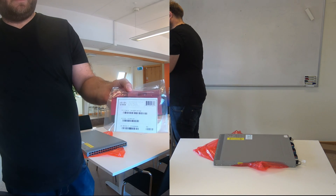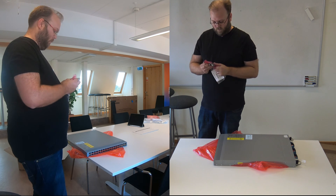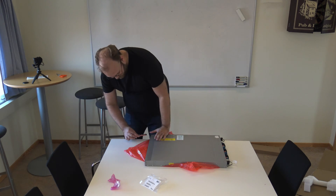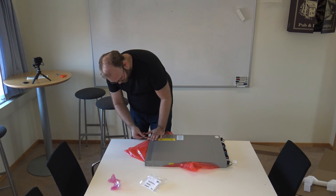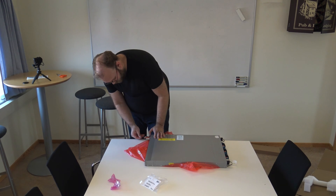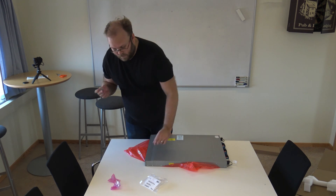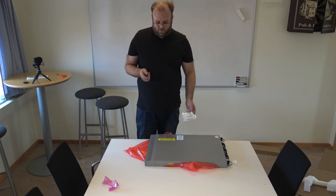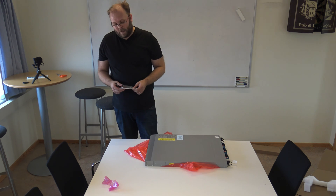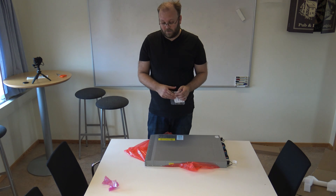This is a 10-gig adapter — genuine Cisco. You just slide it in, and there's a little flap to pull it out. This is useful if you don't have 100 gigs — for example, if you use this for an IPN or DCI node and you have 10-gig routers for your WAN MPLS networks or something, you can use this and get 10-gig ports. 100 gigs for long distance costs a lot.